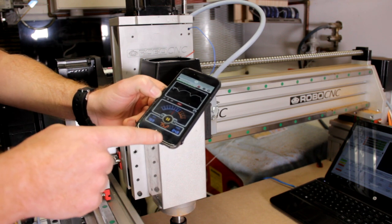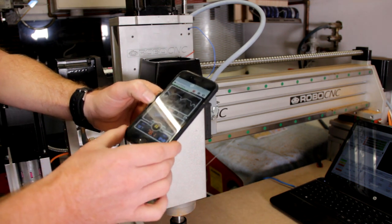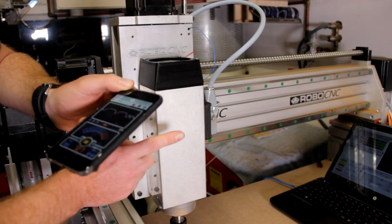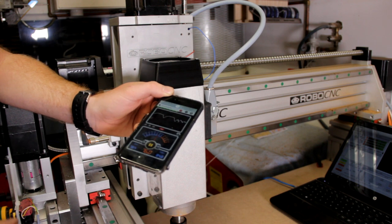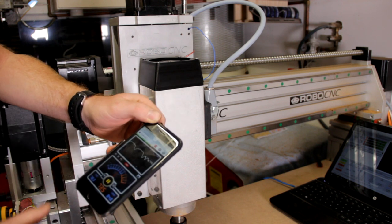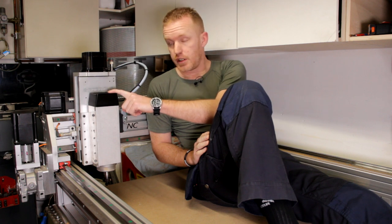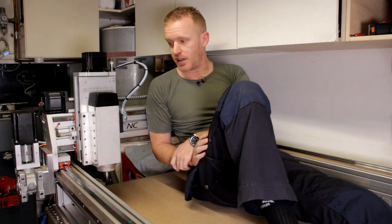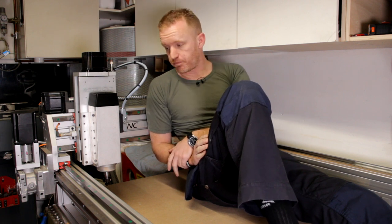So it's 84.8, close to 85 decibels, which is of course more than the spindle without coolant, but then it would break definitely. So from 110-ish to 85-ish, that's a real big difference in noise. The electric cooling project is done. There is a new printed duct with a finger guard, so I cannot put my fingers in there and hurt myself. Sound is still the same as you've seen a few seconds ago.